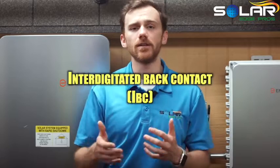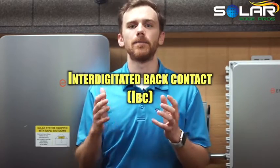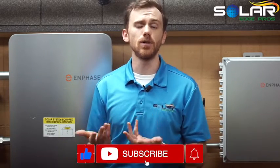That's why manufacturers have turned to a new design of solar panels — Rear Contact Solar Cells. A few solar panel manufacturers like REC have no visible bus bars and instead use interdigitated back contact technology to channel electricity to your home. Their reliance on complex patterns and razor-thin bus bars placed behind the solar cells result in less shading and a cleaner look, while still having plenty of bus bars available for those sunny days.